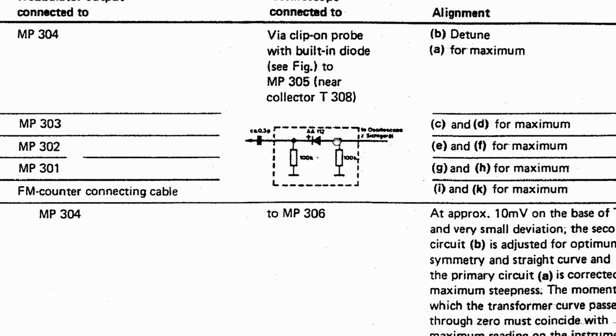I've gone one step further. I've actually put a small capacitor, a 1 nanofarad capacitor, between here and here in parallel with that resistor. And it means that the curve doesn't have much RF on it, so it looks cleaner. That goes to the scope, and that is connected to the detection point.